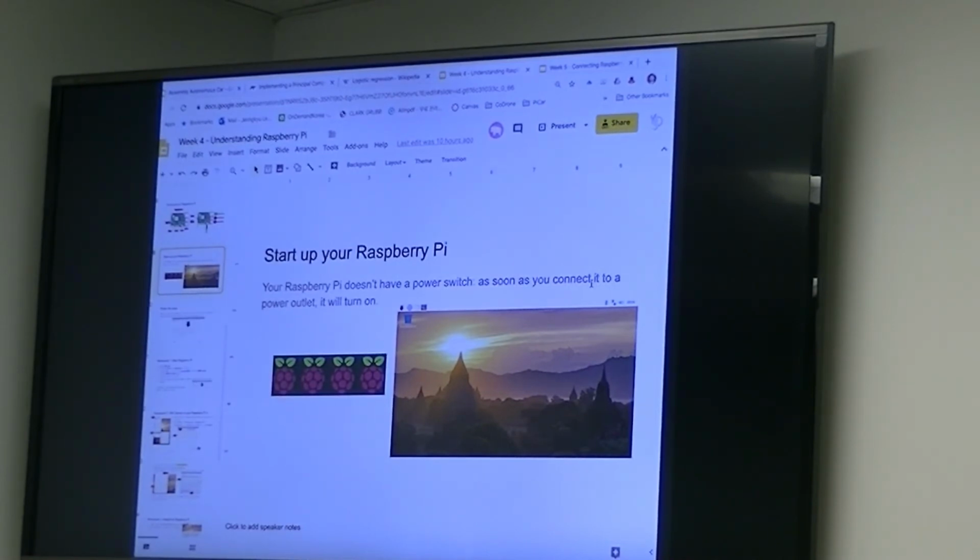So later, after you leave, please go to the top right corner menu. There is a Wi-Fi icon, and select your hotspot. Then restart. Then you can connect your Raspberry Pi to your hotspot. Then from your VNC viewer, you need to connect your laptop to your hotspot, okay? Then after you leave, you are able to connect to your Raspberry Pi after you turn on your hotspot, okay?